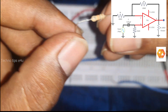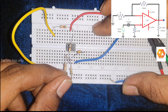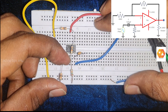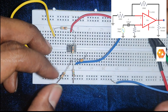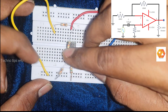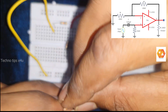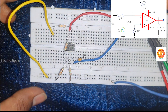The 10 kilo ohm resistor is connected between pin number 2 — the inverting input terminal of the operational amplifier — and ground. This is a non-inverting amplifier configuration, so the input and output are in phase and the amplitude gain is greater than 1. The voltage gain equation is 1 + RF/RI. Since both RF and RI are 10 kilo ohm, their ratio is 1, giving a voltage gain of 1 + 1 = 2.